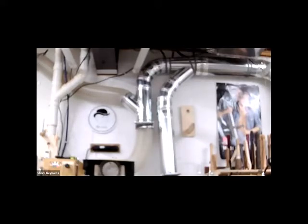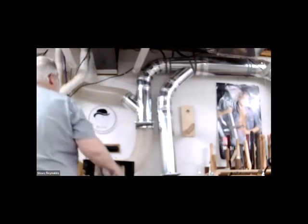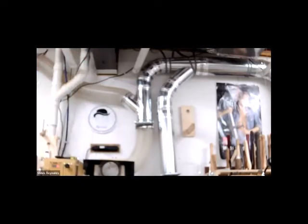The takeoff I've got here, theoretically, it's in the wrong direction. It doesn't have the smooth airflow, but because I needed to take it under this beam and over the shelves over there, it just made more sense to me to mount it that way. And because of that 6-inch duct work, it pulls it. It doesn't even care that it's pointed the wrong direction. So I made a conscious decision to try that out, and it worked like a charm.